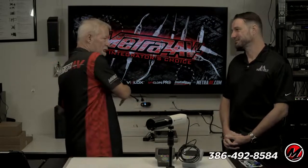Yep, same. And as a side note, all the complaints that we have about HDMI distance and capabilities. Right. Oh, we didn't have those problems with the component. Yeah, you did. It's still a cable, you know. S-Video was meant to go 6 feet. Component in the early days was a replacement for VGA meant to go 6 to 12 feet. We made it work. But it wasn't meant to. HDMI, now we're up to 300 feet for 8K. There's a lot more going on with that.